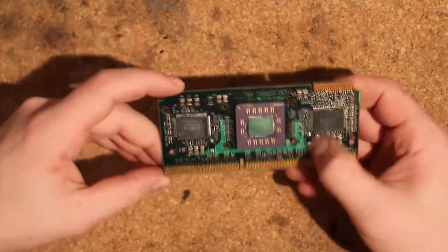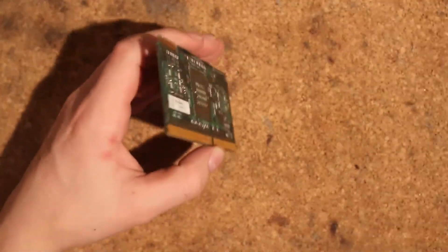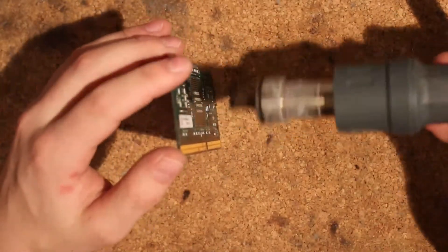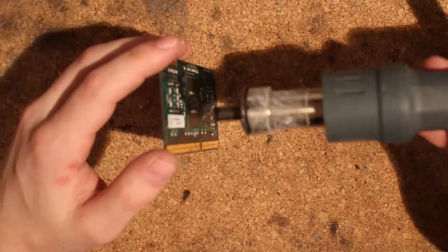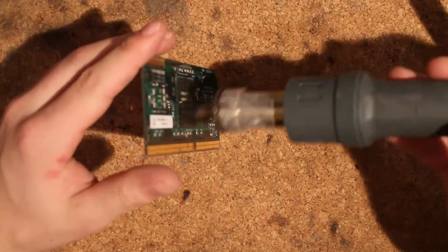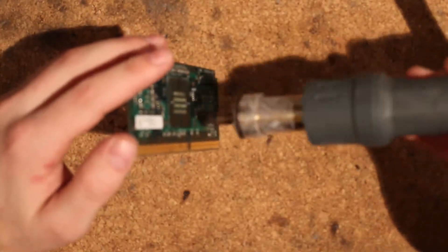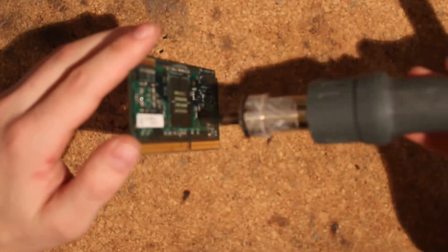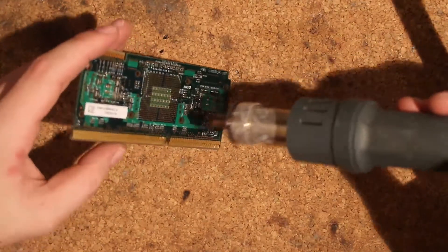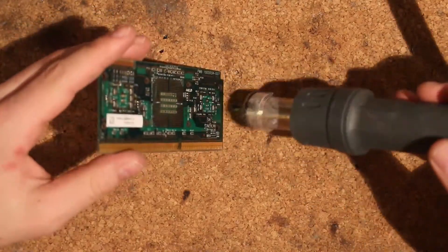Anyways, let's get cracking and remove the cache. The cache is already long gone on this one. Preheating the PCB a bit. I'm still not sure if I'm going to heat it from the back and hope they fall off, or heat from the front and sort of force the chips off. Because with removing them, it's not really important if we destroy some traces - we're not going to use this chip anyway.